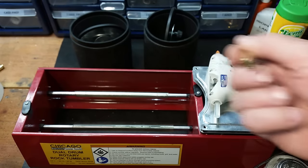When you get these Harbor Freight deals, let's face it, these are not the best, so take some time to make adjustments. There's a little pulley on this fan - you can loosen it and slide it back and forth. Mine actually looked like it had been dropped; the weight of the motor had bent things out. I took it all apart, flattened it back out, and it works great. There's a little bit of wobble I couldn't get out, but as long as the pulleys align it seems to do pretty well.